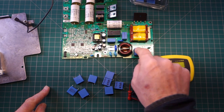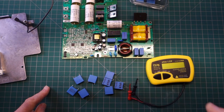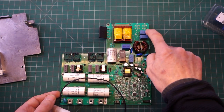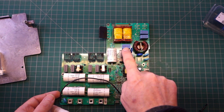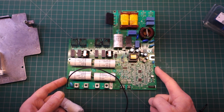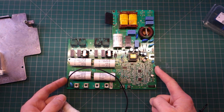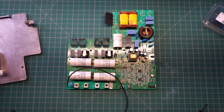So there we have it - I've just changed out these three capacitors. I did test this one in circuit and it's still showing over 600 nanofarads, so I'm going to leave it in circuit. Other components on this board are apparently weak and could probably cause problems, but I haven't actually found that in my cases. I did buy the spare parts but haven't ended up using them.